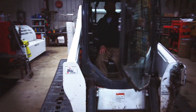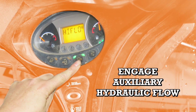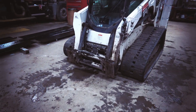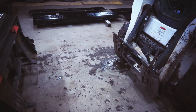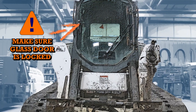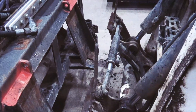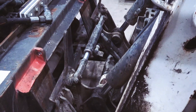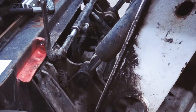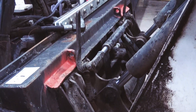You need to have your lap bar down and then press your buttons to activate your hydraulic controls, so we'll pull ahead. Another feature of this particular machine: with the glass door, if the door is not locked all the way it won't allow you to raise your arms, because you'd rip the door right off. So we're going to pull in to our attachment, make sure that our top ears are within the coupler, and then lift straight up.